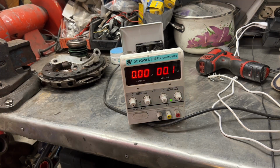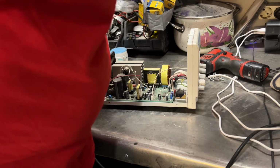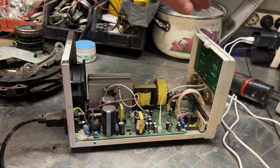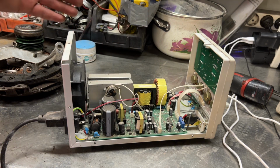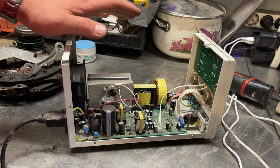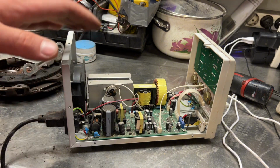Now there are some people suggesting, I watched a few videos before we started, that it could be a diode or something. If you're missing the voltage, it's not a diode. It's a MOSFET problem. I'm 100% sure it's a MOSFET. There is nothing switching the voltage, so it's not showing any voltage. I'm not an electronics person. I repair automotive sometimes and everything, so keep that in mind.